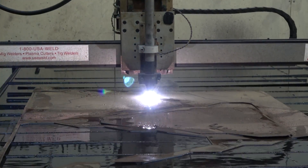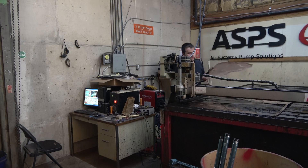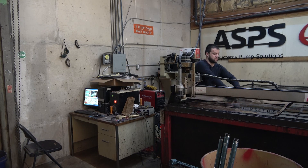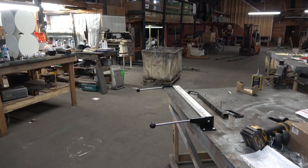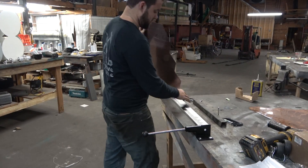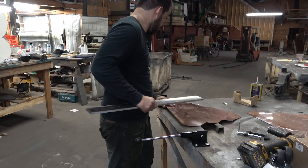As far as the actual plasma cutting of this copper, 24-ounce copper is just about the same thickness as 20-gauge steel, so I figured let's start with those settings — they worked great. It was a pretty clean cut, just a little bit of a bubbly or bead-like dross on the edge of the cut, something like what you get sometimes with stainless. It cleaned up real easy; copper is soft, so it's not going to be a hard process to work.